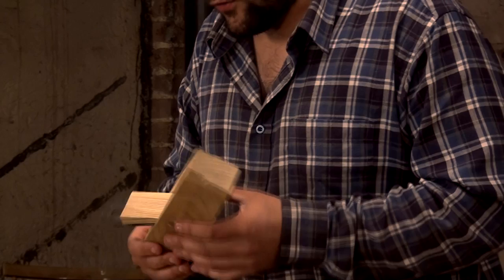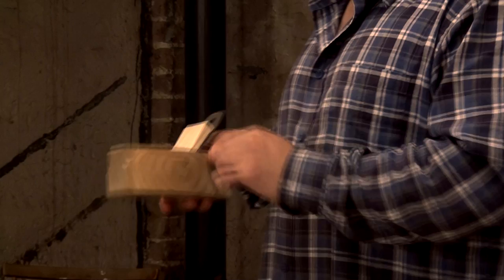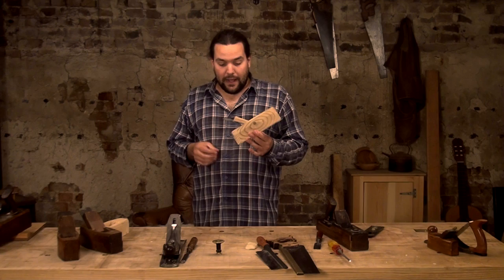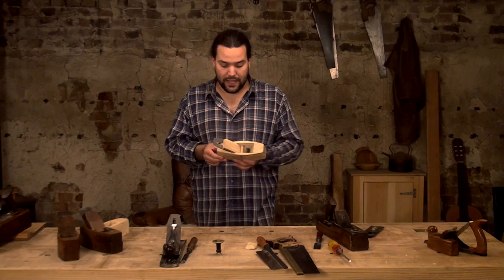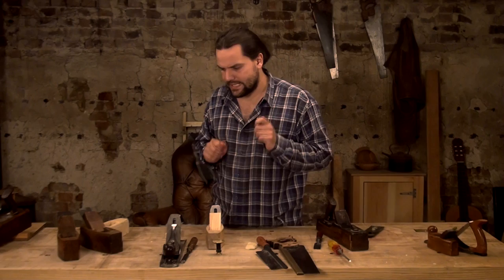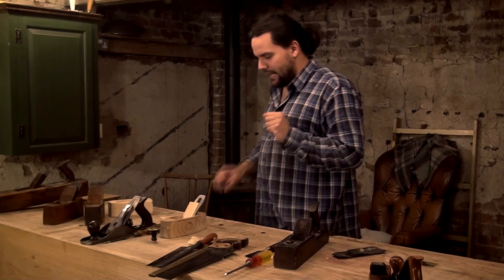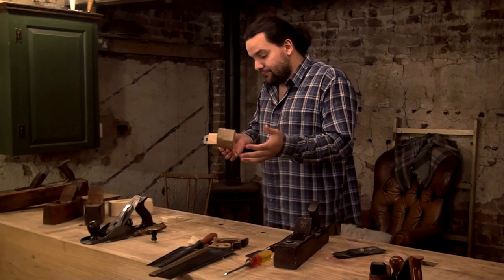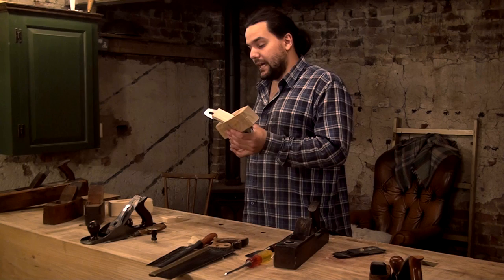I've been using this for about a few days now and I've absolutely given it some hammer — testing the best I can. I've pretty much smoothed an entire workbench with it, just done the top as well, and it was rippled ash, and it performed lovely. It's up there with the best of my planes — it shocked me. And the most shocking aspect was actually the adjusting; I've never had a plane that's responded so well to the hammer. Helen started woodworking last year and I made sure she started with wooden planes — I pretty much confiscated every metal plane from her, and she's doing very well. When Helen first had a go with this, the first thing she said was how well it responded to the hammer, how easy the adjustments were. And that is just another perfect reason for this to be your first introduction to wooden planes, because the setting up and the adjustment is so much easier.